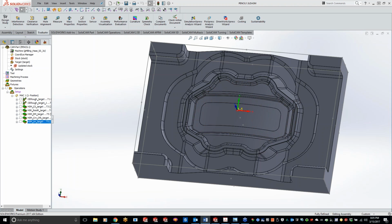It's basically adding, so we have our single line going all the way around here with our pencil milling, but then what it does, it kind of takes into the 3D constant step over, and you can also extend those passes out by however many you specify. So, you guys can say, let's say I want 5 steps, and it's going to go 5 steps inwards, 5 steps upwards on the amount that you specify.